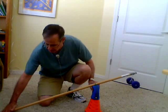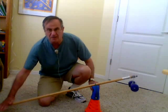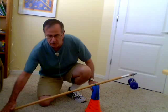And because of that, I can lift this weight by exerting only one half of the force that the weight actually has. So I'm able to push down with a force of two and a half pounds in order to lift this five pound weight. I have a mechanical advantage of two. So I'm pushing down with a force of two and a half pounds and I'm lifting the five pound weight.